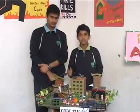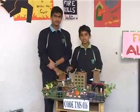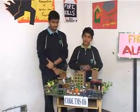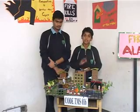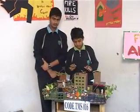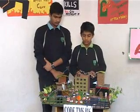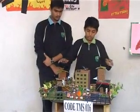As the sensor — here we have used a starter of a tube light. When we heat it up, there are two metallic wires inside this starter; one will expand earlier, so the circuit gets complete and the speaker starts running. As you can see, we have placed speakers outside also, because if any fire takes place in this building, it will warn people around these buildings.